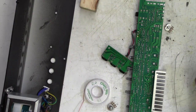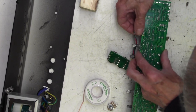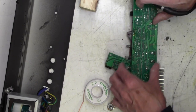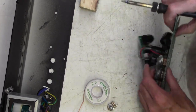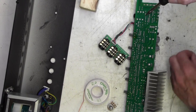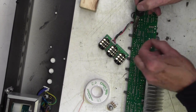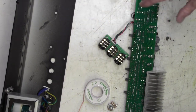How to put a pot in - the difficulty is holding it. It's very easy to put in but it flops around, so I'm just going to tack it in with one little bit of solder. Now I can position the pot - needs to go in a bit more - and I want to make sure it's lined up with the others by looking along it, which it is. So now I can solder these in properly. I think you'll agree, fairly quick pot replacement.